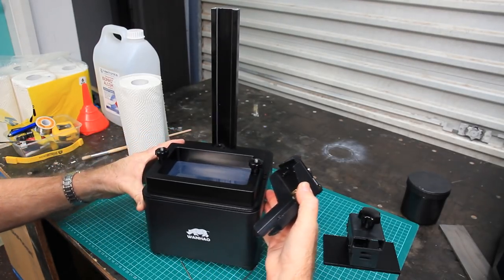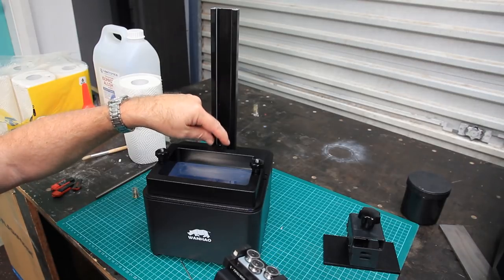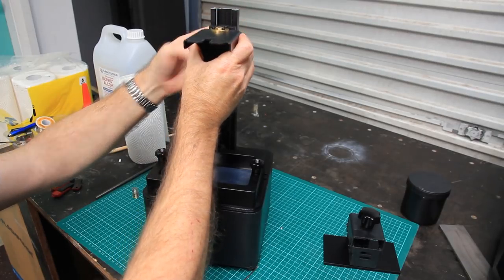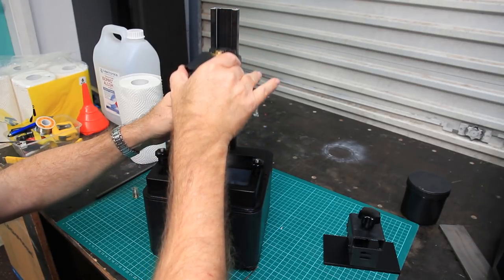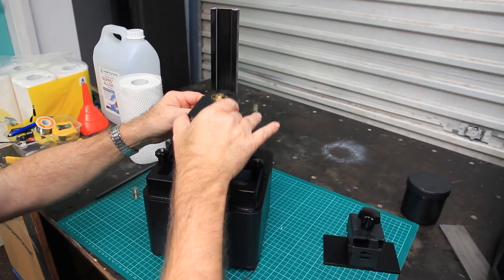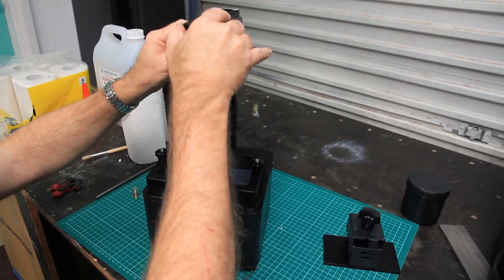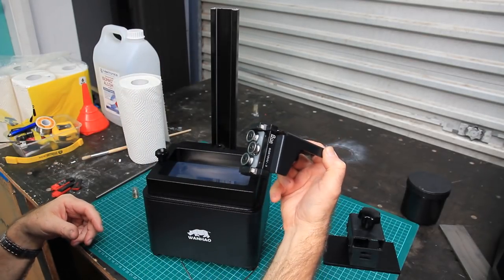So if you're tuning your machine mechanically, one of the things you can do is what I've just done: take the lead screw out. It's not difficult. It just clamps into the flexible coupling, and then reinstall your truck and platform, and just let the thing roll up and down. And what you're looking for is tight spots, or if there's any impediment to free and smooth movement. Now, that feels pretty good to me. So that definitely is good for the job.